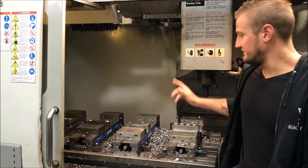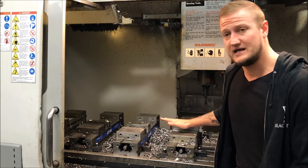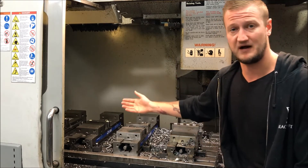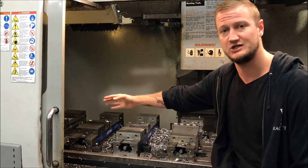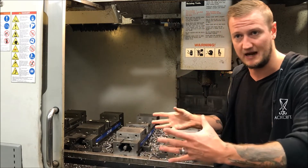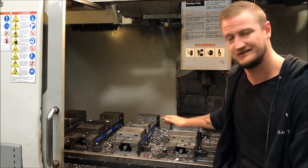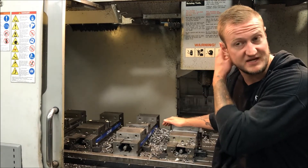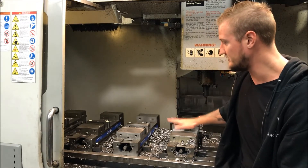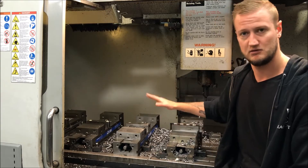In here I leave these five GS5 double vises set up pretty much 24/7 in my Haas M5. These are handy because I can take out the center jaw and run big things, or I can run two different things at a time, and because I've got five vices in there, I can run long stuff up to 60 inches. If there's stuff that's going to flex, I can take out vices and put in more vices closer together, pulling up more of it. We've been running long stuff pretty consistently. This is a pretty typical setup for this machine — and again, my favorite phrase of the day: the first line of attack. This is it. Vises.